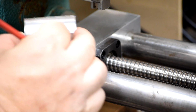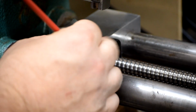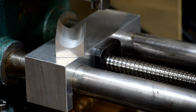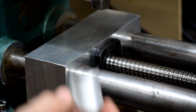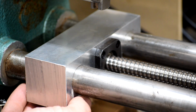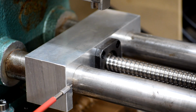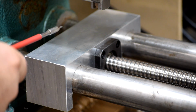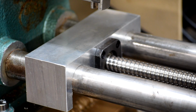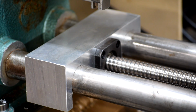In order to get this on, because I couldn't take these bars out, I had to use the bandsaw and slot in underneath, which gave me these pieces here. That raises the possibility that you could then mount that underneath with a clamp to lock it in place. But it turns out that because there's a little bit over center on these things, when it gets pressed down, it actually pops into place like a snap. So as of right now, it doesn't appear to need the clamp.